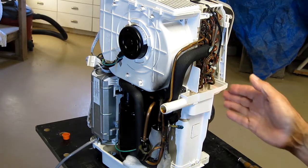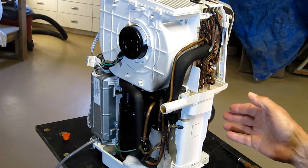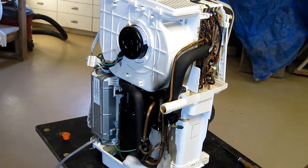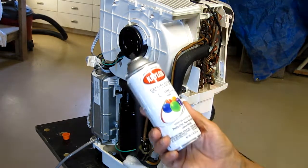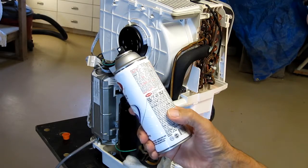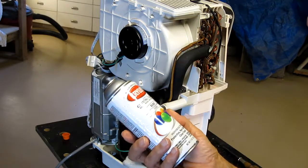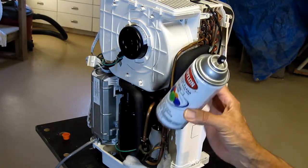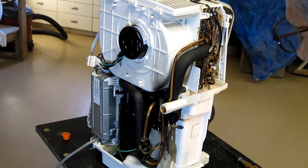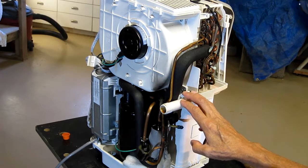So that's the question: why not use propane for refrigerant? Well, obviously it's flammable. But keeping everything in perspective, there's about five ounces of propane in here. And here I've got this can of spray paint, like many people probably have — and what's in it? Acetone, toluene, propane, butane, etc. That's pretty flammable too, and how many of us have one of these around? That said, I'm not going to put this thing next to my water heater, but it is out in the shop. It's been working just great. The experiment was a success.